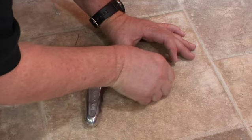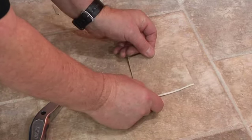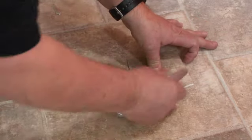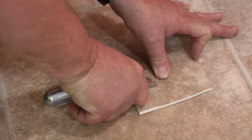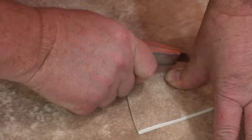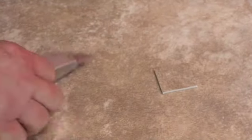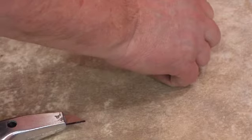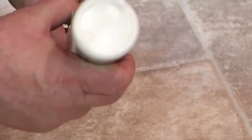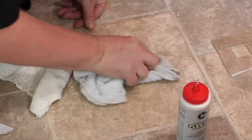Use double face tape to secure the replacement piece over the existing material while cutting. Hold a utility knife at a 90-degree angle and double cut through both pieces of flooring. Square edges are important for a professional-looking and hard-to-notice repair. Remove the damaged piece of material. If the flooring was installed using the loose lay with tape method, center acrylic double face tape under all seams, making sure the tape does not overlap. Remove the protective paper layer from the tape. Apply seam sealer to the edge of the replacement piece and position the replacement material into place. Roll all seams firmly with a hand roller and wipe off the seam with a clean damp cloth followed by a clean dry cloth.